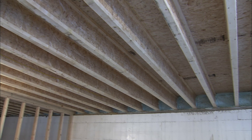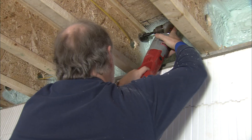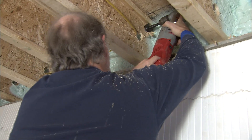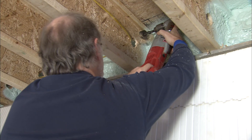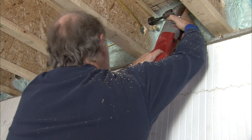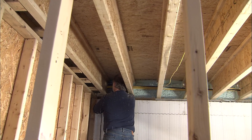In this presentation we will be installing a tubing circuit covering three bays. Using the right angle drill, make a one and a half to two inch hole in each of the joists for the entire length of the floor. Holes should be roughly six inches in from the rim joist and two to four inches down from the top of the joist. If there will be many circuits of tubing within a zone, you may have to drill more than one hole in some of the joists.